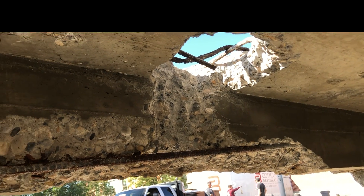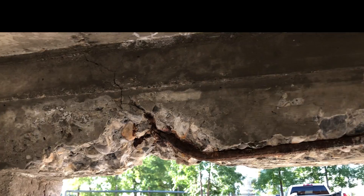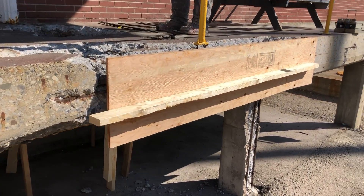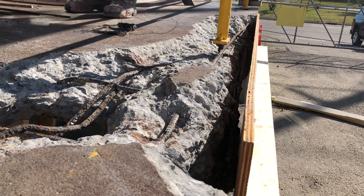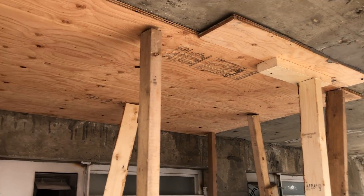You can see we're coming right through the slab here. We used our jackhammers to remove all the damaged deteriorated concrete, cut out any rusted loose rebar, and then we start a pretty unique forming process. You're not starting right from scratch, so you have to use what you have and start attaching the forms to the structure so we can start refilling all that removed concrete.